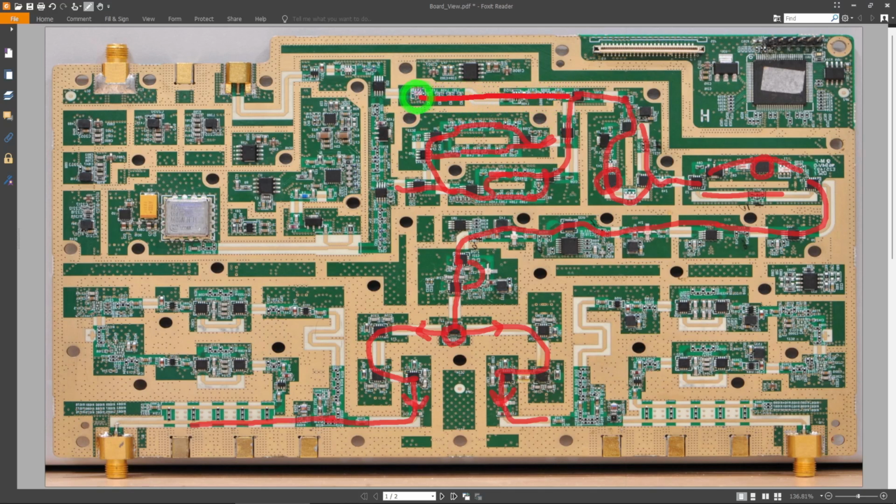And this path over here hits this component. Now this component is a mixer, a downconvert mixer in this case, where they're using the IF of this mixer, I believe, to cover everything below 1.5 gigahertz. And we'll talk about why that would be needed. Now the other path would be this path, which is taken directly. If you look at this, the LO of this particular mixer, this is an LO signal coming in, the LO of it comes from another synthesizer board. And again, they're using that to go below 1.5 gigahertz.